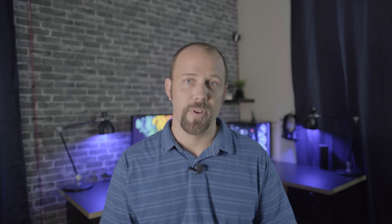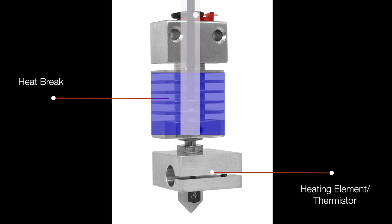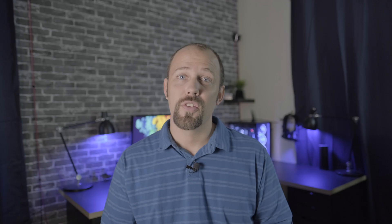If you're not familiar with how the hot end works, let's bring that picture up. The heat break is what helps create a specific zone in which the filament melts below and travels to the nozzle, and stays cool above to avoid heat creep up into the Bowden tube. If the Bowden tube isn't seated properly, it can allow that heat creep to melt the filament before it reaches the nozzle, leading to inconsistent flow and inconsistent prints. So once I took out that Bowden tube, I could see there was a PLA goop fest happening inside that hot end.